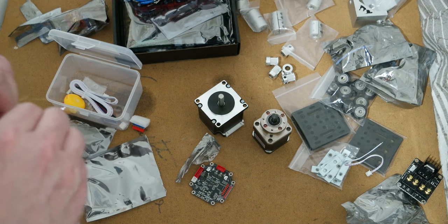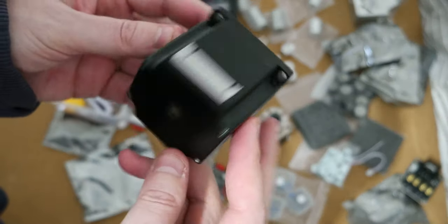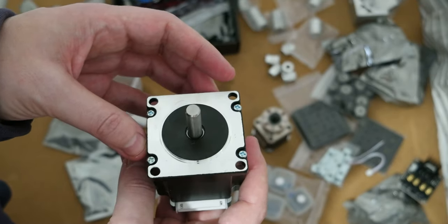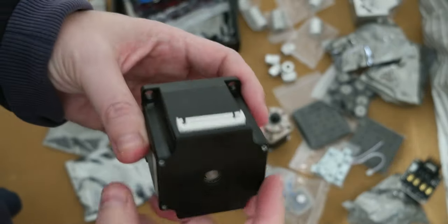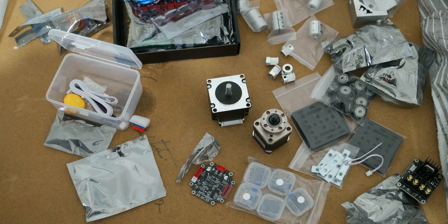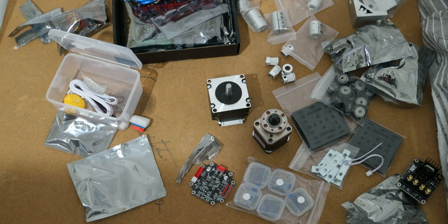I'm still waiting for the other pieces for the 3D printer. I'll share the design in another video. Hopefully the NEMA 23 motors will be strong enough for lifting the entire X axis with the two extruders, which is going to be maybe six, seven — probably even ten kilos. I have two of these on the X axis, so it should work. If not, I'll have to step up to even stronger motors. If you have any questions please leave a comment, subscribe to the channel, share the video, turn on notifications, and I'll see you in the next video. Thank you, bye.